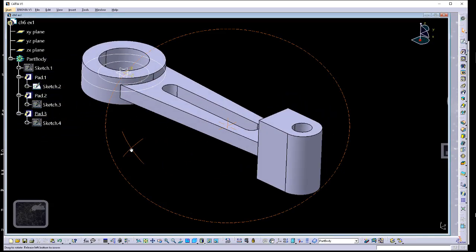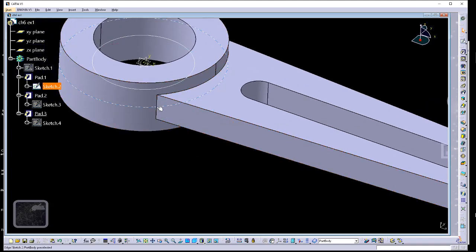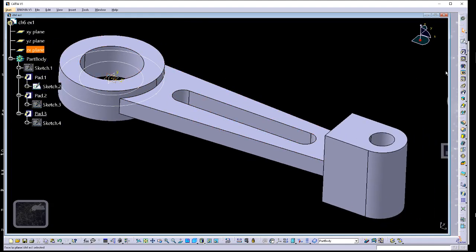I make all the elements visible, hide the original sketch, and pad this outer shape with mirrored extent. The total extrusion depth given is 70, so mirrored extent is 35 each side. For the fillet visible in the control image, we're going to handle that in part design using the fillet feature — not at the sketch level. Doing fillets on hard surface edges at the part design level is more efficient and easier for the computer to process.